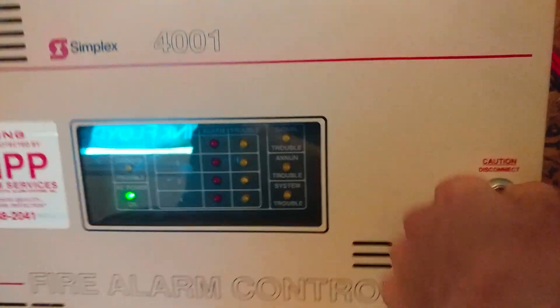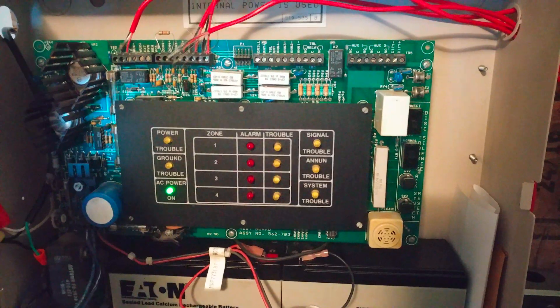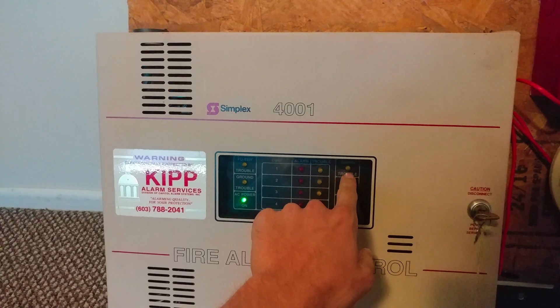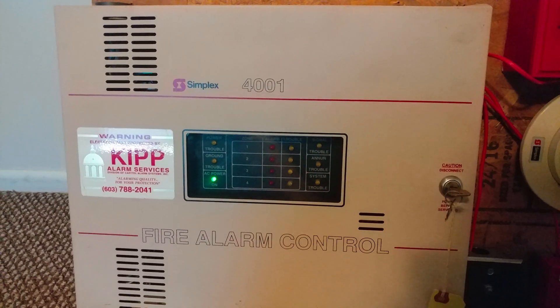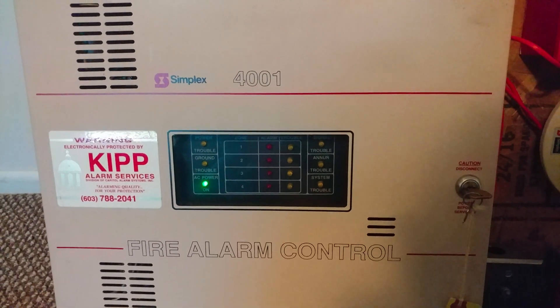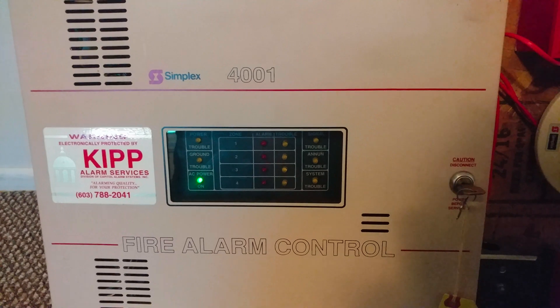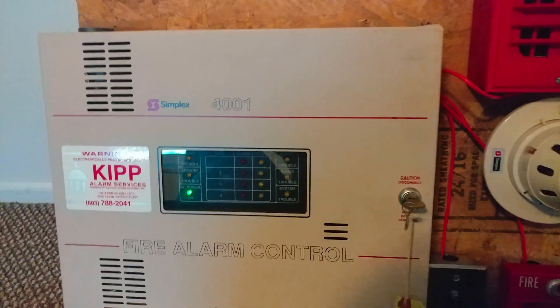For the panel, as you can see, there are no troubles. I know last System Test — Mini System Test 9, when we did the AV32 — there was a signal trouble. I actually figured out what the problem was: the resistor wasn't making contact or closing the circuit correctly on the AV32, because the AV32 has pigtail wires instead of terminals, and I prefer terminals over pigtail wires. Since I've put a different notification plan in, the circuit's closed and the system is now all back to normal.